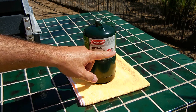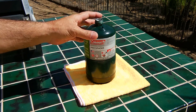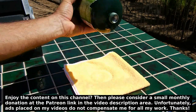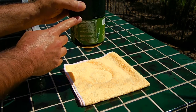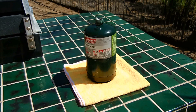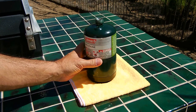As stated earlier, to keep the liquid from vaporizing once exposed the temperature would have to be around minus 40 degrees Fahrenheit. So we need to get the pressure much, much lower before removing the valve core, then invert the cylinder into the container. The vapor pressure above will push the liquid out through the opening into the container where you can collect it. To do that, place the cylinder in your freezer for about 15 to 20 minutes to cool it way down.